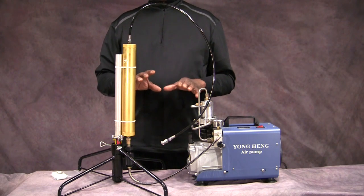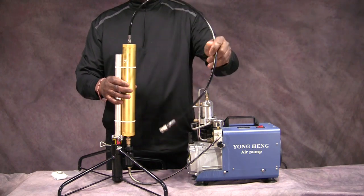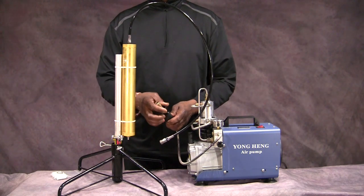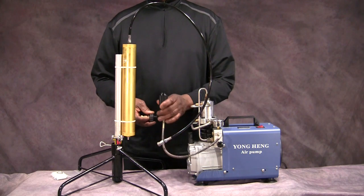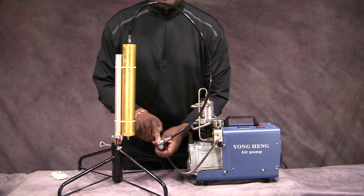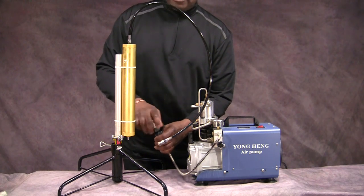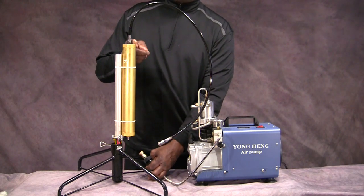Let me talk about how I've set mine up — maybe it'll work for you too. I put this in an upright position so everything travels up and out into your tank or gun. One thing that's very important is this so-called first stage filter. This first stage filter was the only filter I was using up until now, and when taking it apart I noticed it was filtering both oil and water — this thing was damp. So in this new system, I want this first stage to be primarily for oil, making sure no oil gets into the system. There's a cotton ball in there — you have to change these out every so often. And I also put a cotton ball in the bottom of the main filter as a secondary oil catch. All the rest of it is dedicated to catching water before it flows into the system.